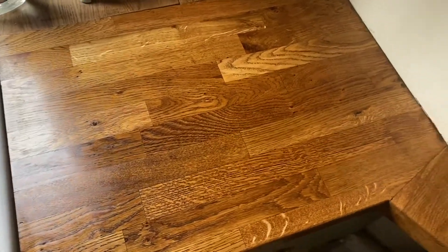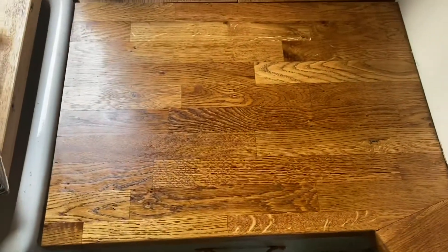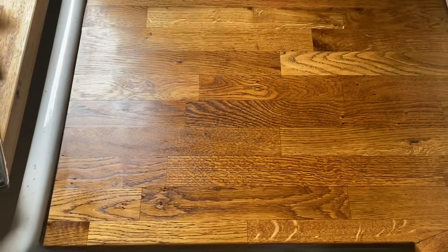Sorry Holly. That's after the first coat of Danish oil. You're meant to give it quite a bit on the first one to let it soak into the wood. As you can see, it looks a lot better than it did. It's getting close to that now. It's a bit different under different lights, but it's all good. I've brought out that grain nicely now.